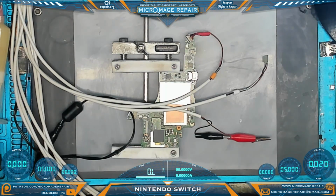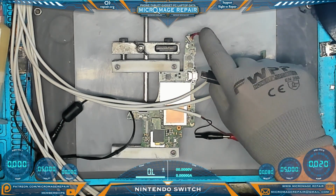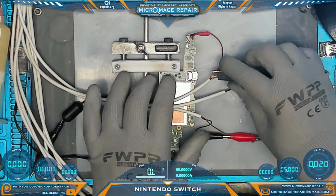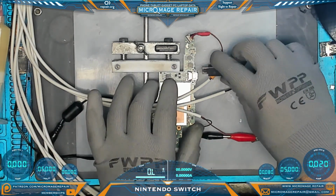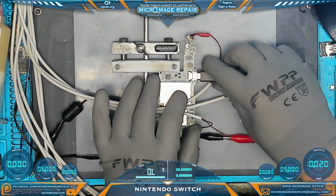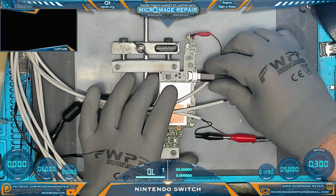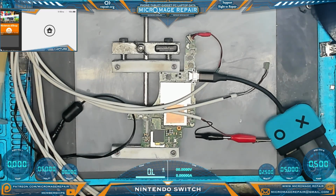Excellent. Now on PSU channel 2, using the modified iPhone Power Squid, which we have retrofitted with Nintendo Switch battery connectors, we want to see the Nintendo Switch boot up, which will just be a steady increase in amperage without hanging up. We'll activate with the OEM. Just a quick in and out. So far so good. We would like to see docking. Try the other side. There it is, yay!